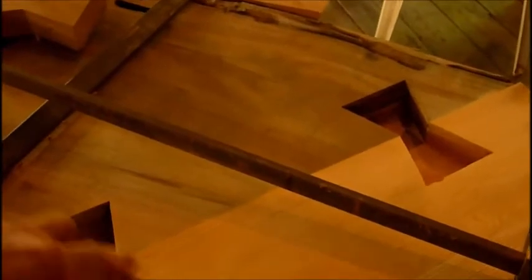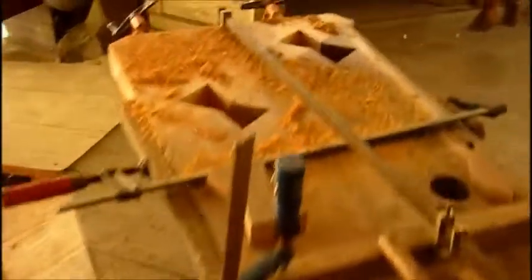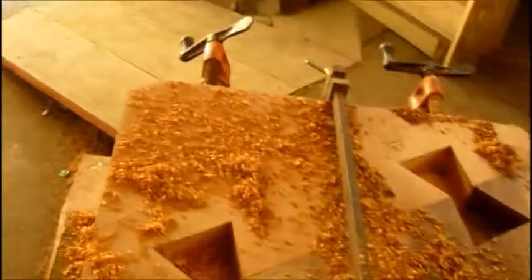For what I call the wings of the table, I put them close to the original tabletop planks and drew my dovetail plug shapes on, then chiseled and routed them out. I wanted that meat to glue to. So now we're getting ready to sink our plugs in, but first I have to finish routing out the depth, and then we'll be ready to stick the plugs in.